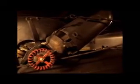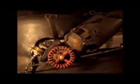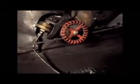Here's the regular whistle that comes with the locomotive. It's a Nathan 6 chime. Here's the shutoff valve for that. And this one, as well as the cord, which was not original, was put on later, thanks to a different valve that's on here. But originally, it ran off there. The whistle is blown using steam coming from the steam dome itself here. But the valve to open it is run by air, which goes into the cab. If I get to explain the engineer's controls, I will show that to you. By opening the valve in the cab, air flows in here, which opens the valve to blow the steam out the whistle. So that's how that works.